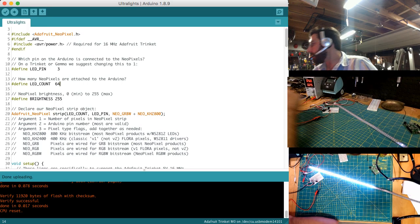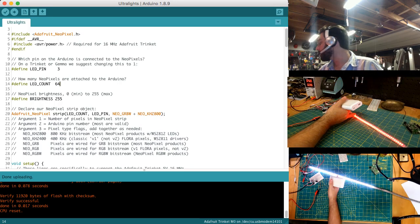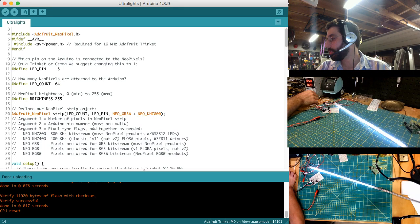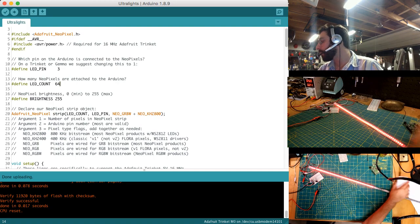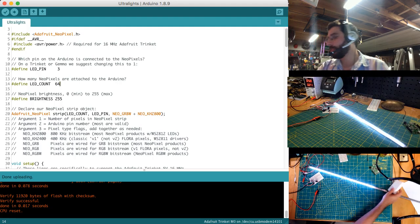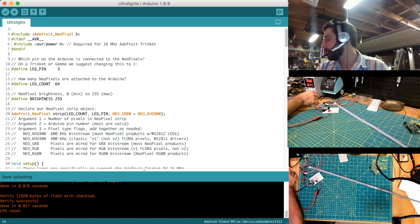With a 10,000 milliamp hour battery, this thing could run a really long time. What did I say this thing was at? 2.4 amps maximum output. Yeah, this battery pack would have no problem powering this strip. I'm not even regulating current right now. If I bring the current regulator down, I think it's just going to cut off. I can't even regulate the power low enough on this.